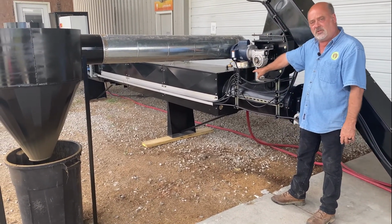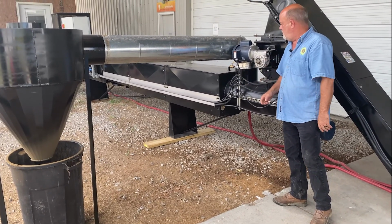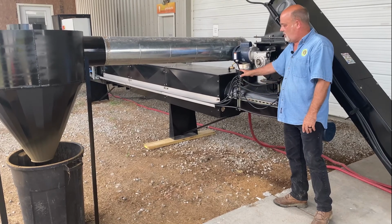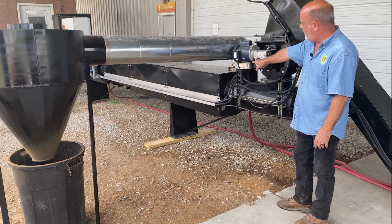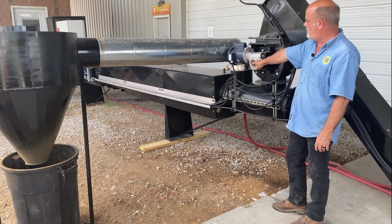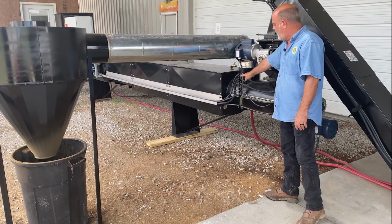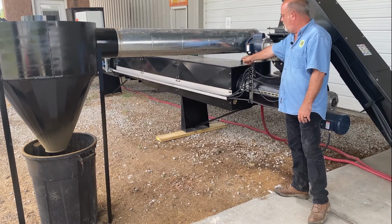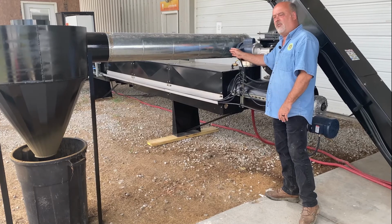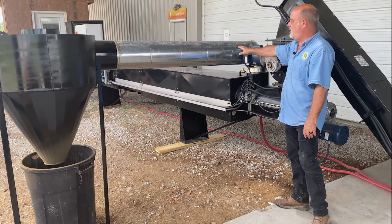And then as soon as you hit this big box here, that is a water jacketed auger. I'll explain the heat system here in a minute, but that will typically be run at about 180 to 200 degrees Fahrenheit on the water temperature. So as soon as you put your wet, hammered material in here, you begin counterflowing up inside this auger 23 feet to the other end.